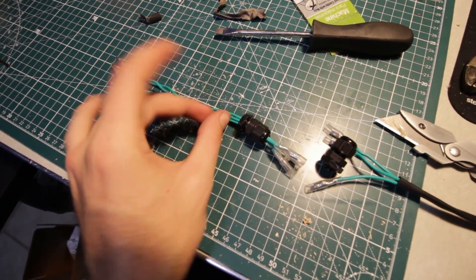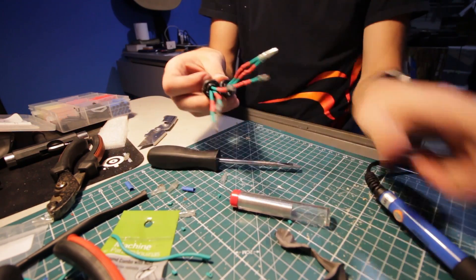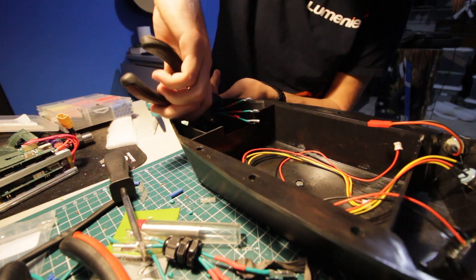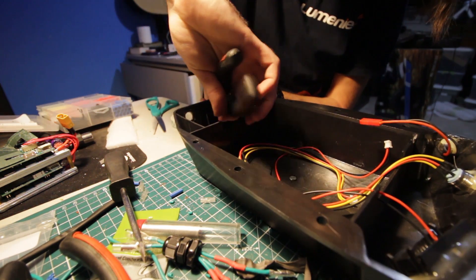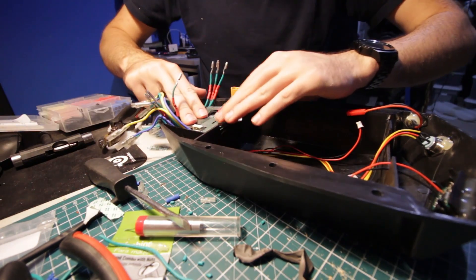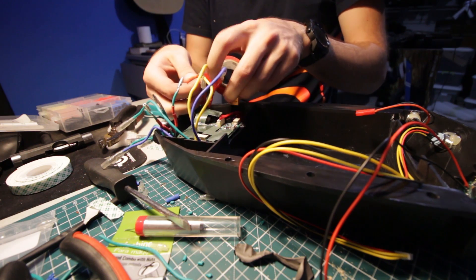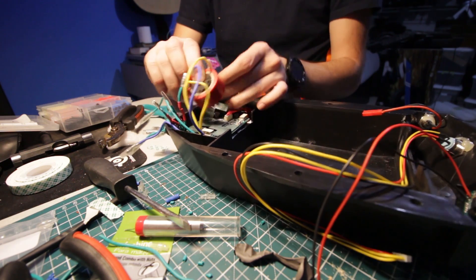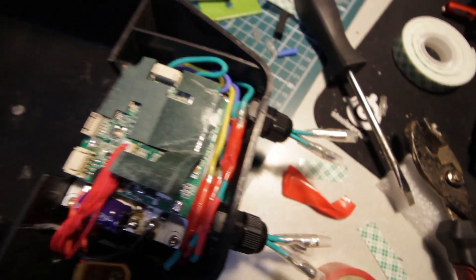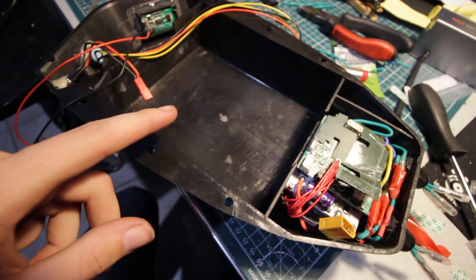I need to make these shorter so it'll fit inside — I want a nice clean look. The SD card ran out of storage but I got two now. I didn't like the way the ESC kept rattling around and falling out of the box, so I used some double-sided tape to adhere it down. Here I am sticking in the pass-through connections that are kind of waterproof — but there are also a bunch of holes in the box so it doesn't really matter. Connect up your wires and wrap them in electrical tape because I don't trust those cheap little bullet connectors. Looks like it'll all fit — ESC doesn't vibrate around. Put the battery in, put the enclosure on, and I think we're done.